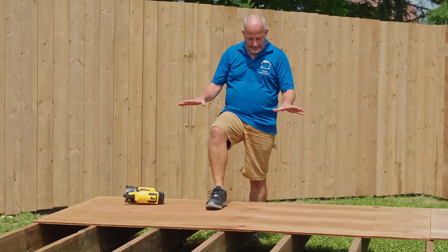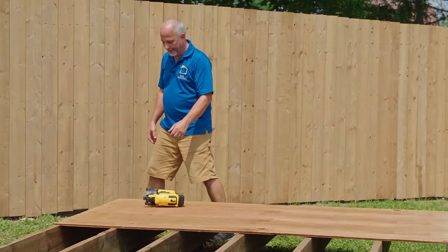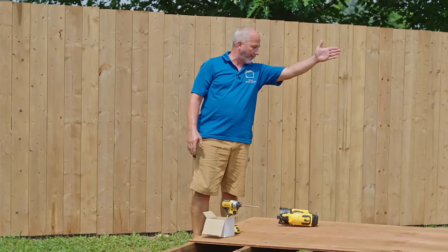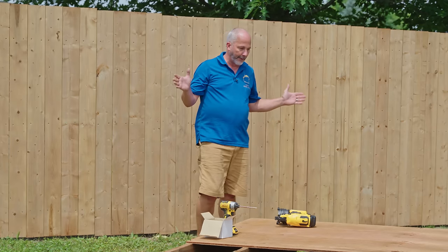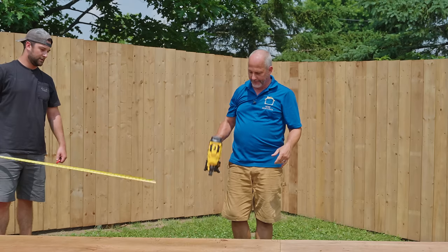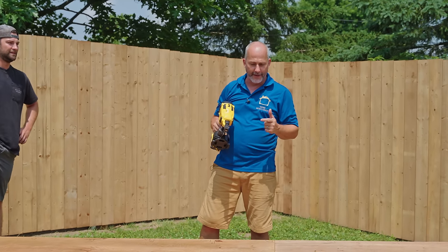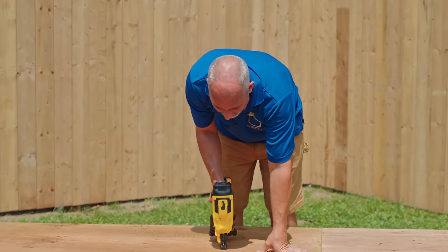Because sheet goods have a curve to them — you roll them out and go from one side to the other, kind of like rolling out pizza dough. Matt's going to get that marked off and then we're going to get this all nailed and screwed down. What we did was have this whole line on the rim joist and we just pushed the deck until everything was nice and tight, flat, and square — and now we know we're perfect. We use this nailer to hang the fence, we're using it to hang the deck, we're going to use it to install our shingles on the roof, and we'll buy a special tip so we can use the same tool to hang our vinyl siding.